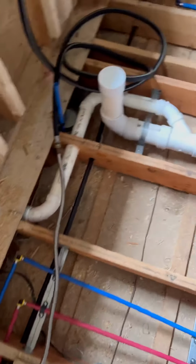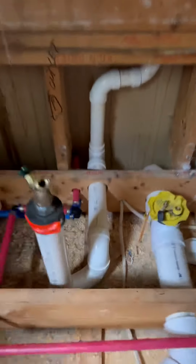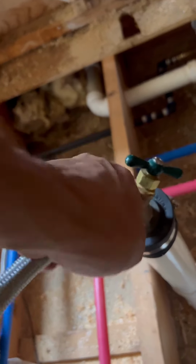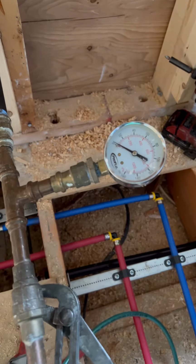So here we are, filling with water. I usually don't do this above finished kitchens, but I knew I had this one. All right, so that's what you use inside of that to hold the water and get an inspection. Now I got the wet vent. That's a toilet and a wet vent for a lav. And now this is the shower drain. So the shower drain got an independent vent through the roof.